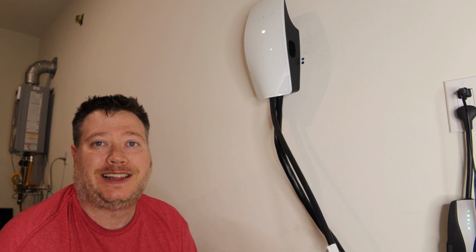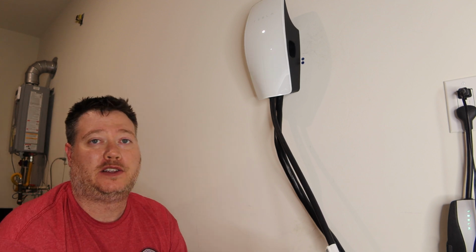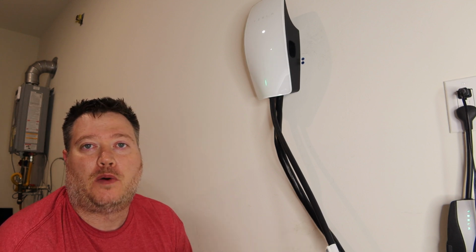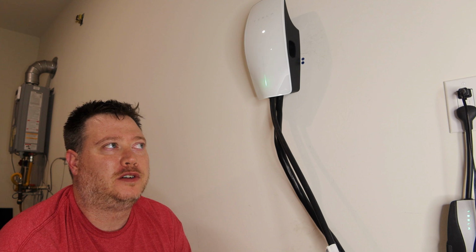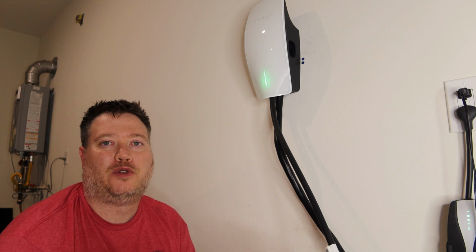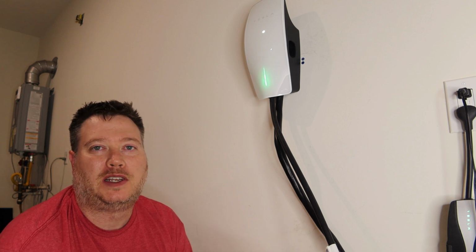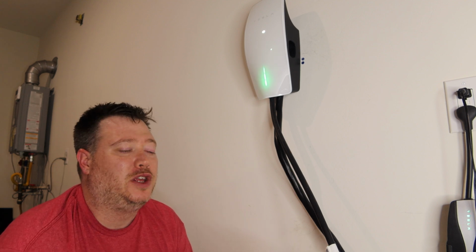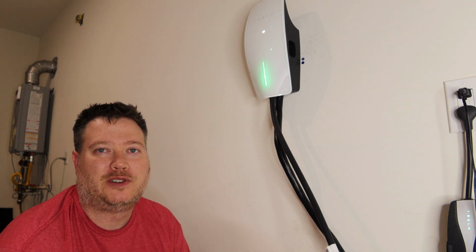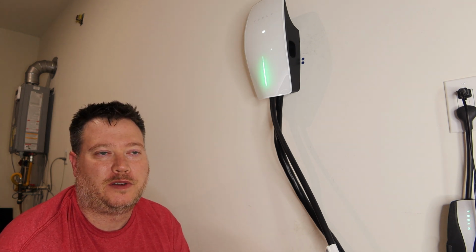It's just they don't really last long term, which is the whole point of us switching out to this industrial outlet. The basic ones you get from like a Home Depot or Lowe's are not designed for regular use, but like, you know, you use your range maybe once a day, twice a day. You use your dryer a couple times a week. So it's designed for those kind of smaller payloads of 240 volt.